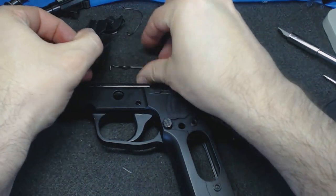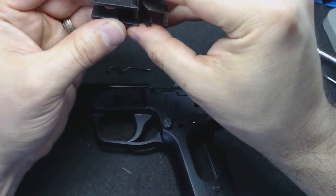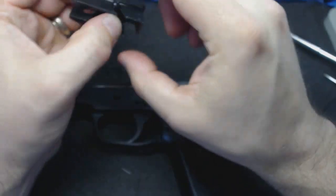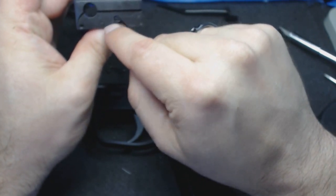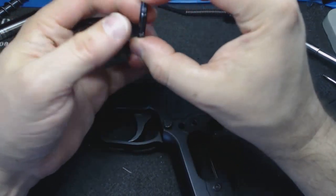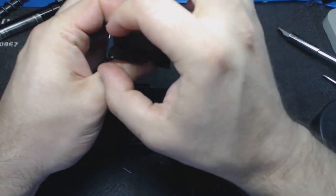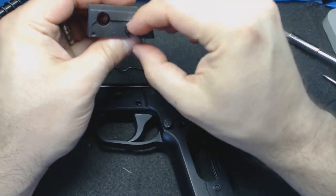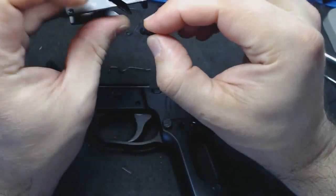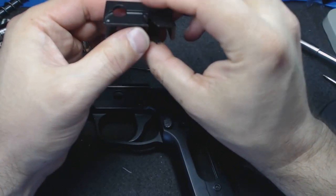That matters because of how it interacts with this piece. This is actually a lock for this piece. So this little cutout here is not wide enough for the whole pin. It's only wide enough for the pin in the exact right orientation. So those grooves on the side, whether it's one or a whole bunch, will always be horizontal, but it's important to make sure that the cuts are towards the front. If you get it wrong and you put it in upside down where the cuts are on the back, it will unfortunately still go in, but now this locking block will be in the wrong place in the gun and it won't settle all the way in. So you'll look at it from the side saying, hey, it's horizontal, it must be right. No, it's not. Those grooves have got to be on the underside of the pin and towards the front of the gun. And then when it locks in, now it'll be in the right position. Flipping that to the other side only moves it a couple millimeters, but it's enough so that nothing lines up.